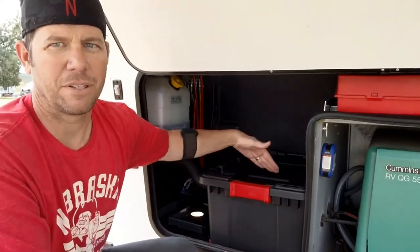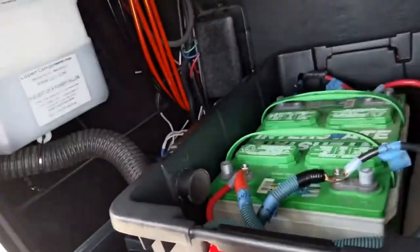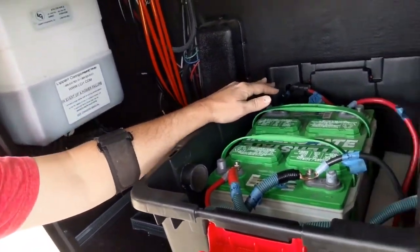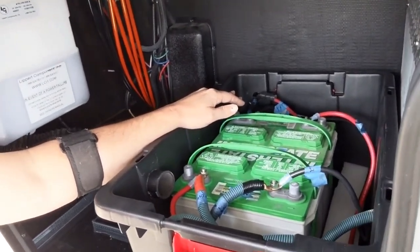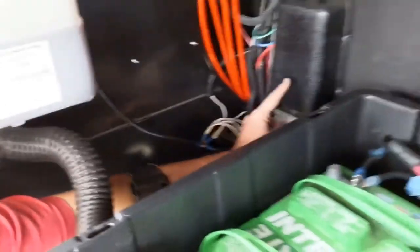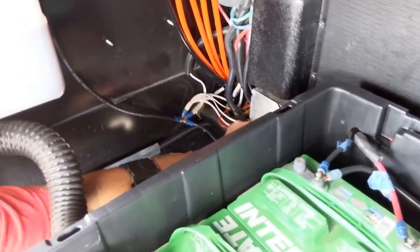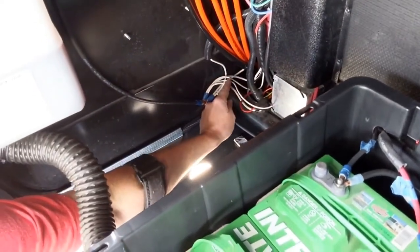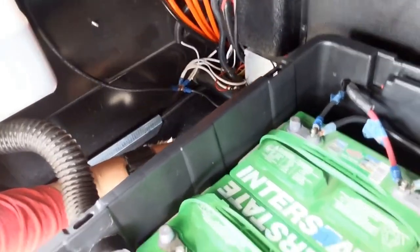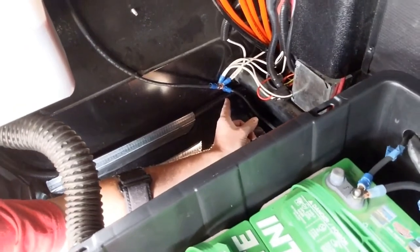Go measure everything and figure out what you're going to do. Here's what we've got going on: my two batteries — battery one and battery two — were sitting over here and over here, just taking up a ton of room. Right now I've got my ground wire over there, and this is where your breaker is. Take that off and you'll see the red positive wire that was strung through this whole rats nest — I just loosened it up and rerouted it.